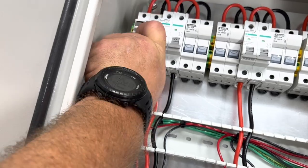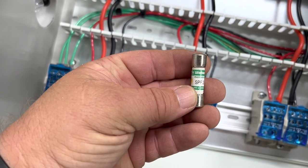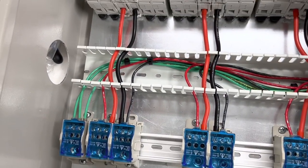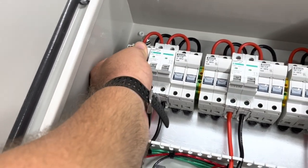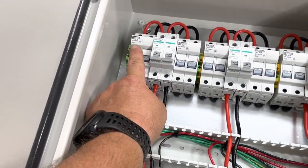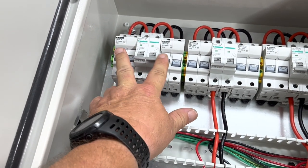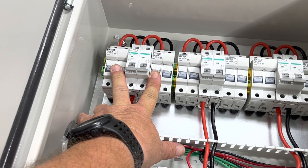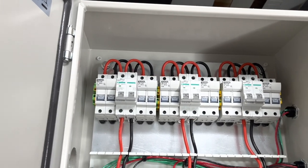Each of these strings has a 20-amp SPF fuse — this is a 1000-volt DC fuse. I put the fuses in there and closed them so I don't lose them while moving this around. I'm having to use fuses because the maximum fuse rating for the panel is 20 amps, according to the Znshine data sheet — and that's what I'm using, Znshine 450-watt panels.